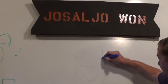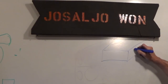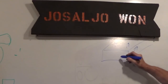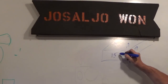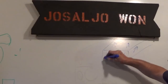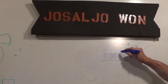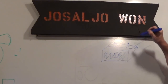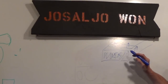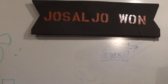So with wood, what happens is you're drying these surfaces here quickly. All right, they're drying, but this dries 15 times faster than the rest of it. This is simply why you want to end coat this, because this dries 15 times faster right in this area, okay? And if it dries 15 times faster and it's still wet on the inside here, this is going to crack. There's no way about it. There's no way to stop it. It's that simple.